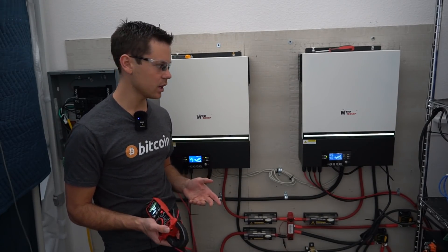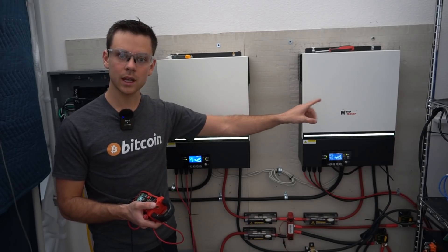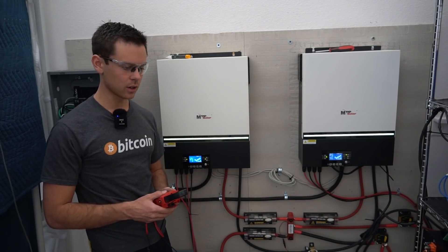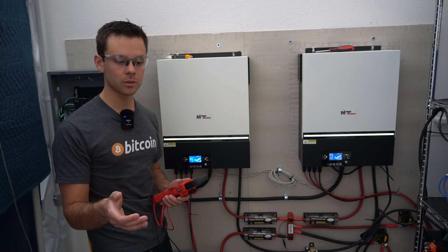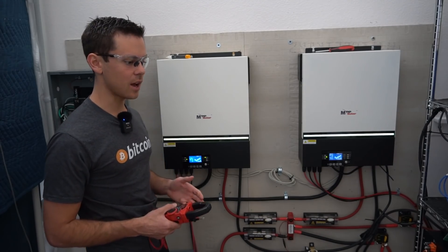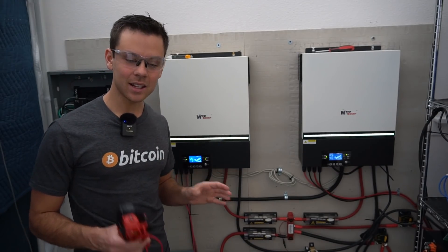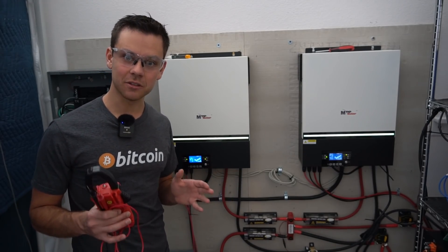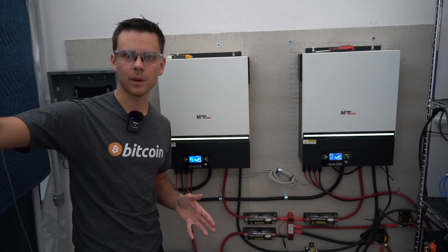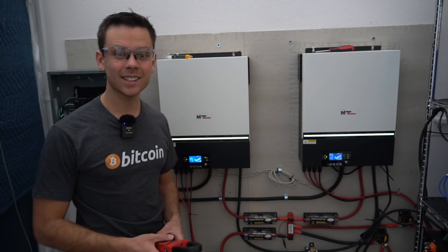I actually mentioned that in my previous video. So when you connect these systems to an earth ground, it should only be at the AC input, not at the panel. This finding is quite concerning because I have seen other YouTubers and people in my comment section — claiming to be electricians — saying you should have a grounding rod connected to the panel for the AC output. That is absolutely false and very dangerous. You'd be creating a massive ground loop. Imagine the charge gradient across my whole property with all of that power going through my equipment — that is not smart.